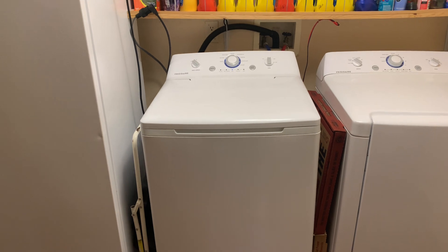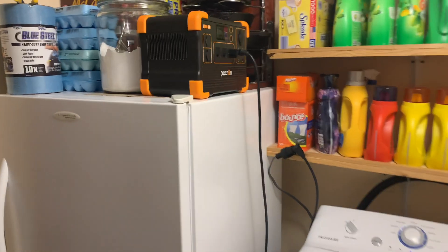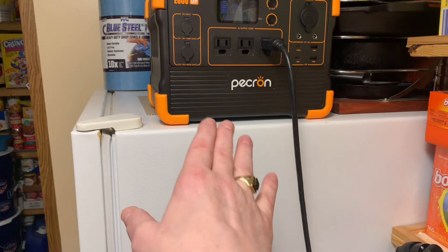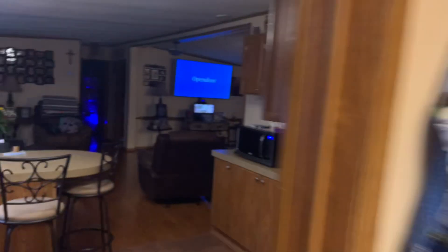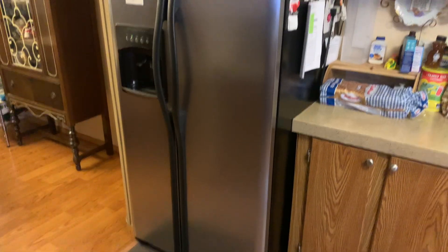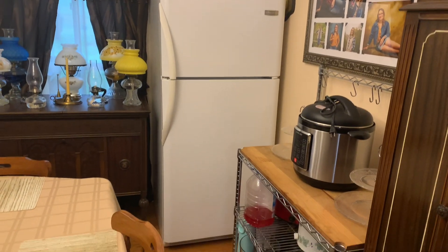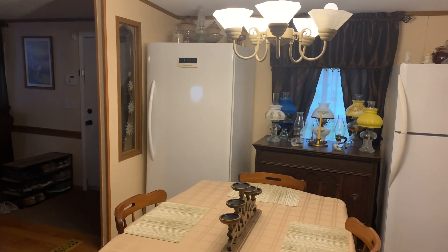If you want to save money on your electric bill, this is a good cheap way to do it. As little as it is — 600 watts — I'm wanting to say it's got a 1200-watt surge peak. It will run this double-door refrigerator for about five and a half hours to five hours fifteen minutes, and it literally ran this other refrigerator for 13 and a half hours.